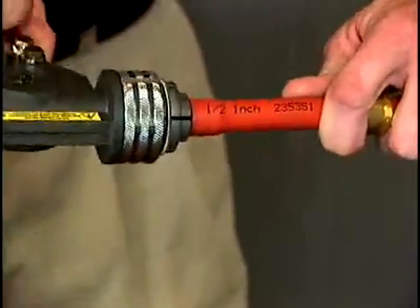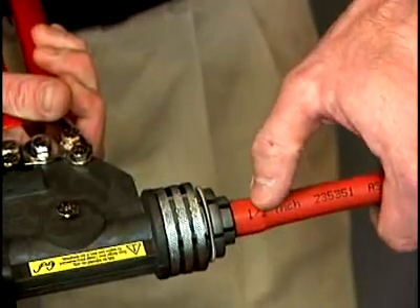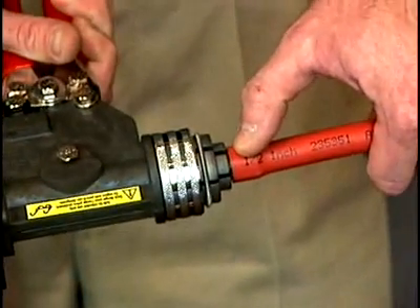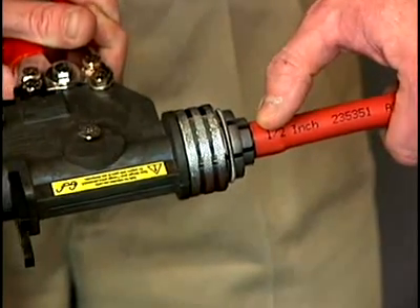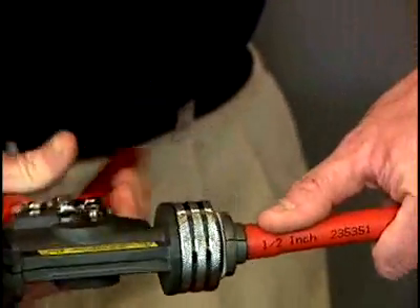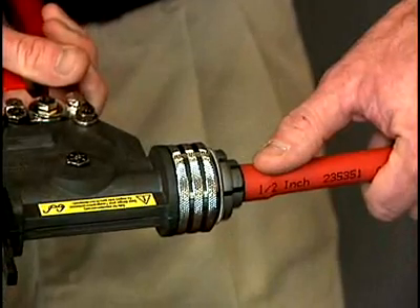Using this hand tool, we put it inside the pipe and with a few pumps we expand it and make it bigger. Now we hold it open for a few seconds, but you'll see that because of these segments the pipe is not perfectly round inside. This means we're going to have to retract the tool and expand a second time. Retract the tool and rotate it just a few degrees to do the second expansion to make sure the pipe is round inside.